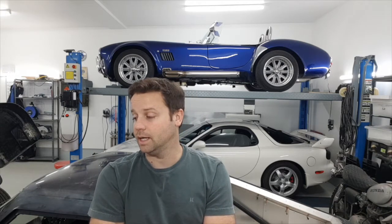The options I talked about at the beginning of the last video — before I knew what I was doing wasn't going to work — was to basically have a large single muffler on either side, which would bring the noise down to the 99 decibels at around 4,000 RPM needed. For me that was going to be a real last resort.